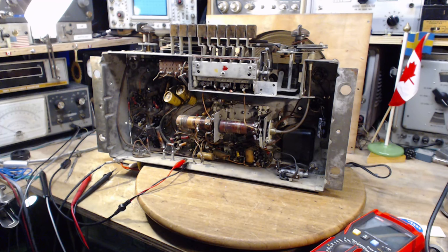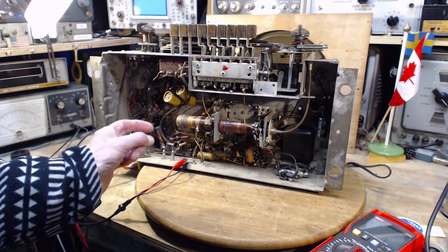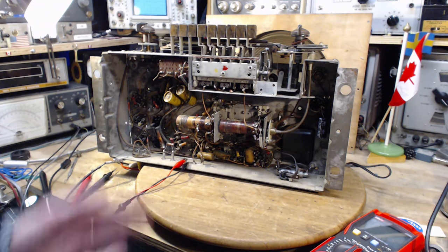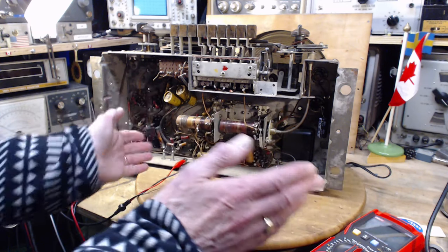Well, that voltage is going to change a lot when I put a parallel resistor in. If I put a resistor of the same value, like let's say 1700 ohms, we're going to cut the overall resistance in half. So that'd become 850 ohms. Then that would split the current half and half.